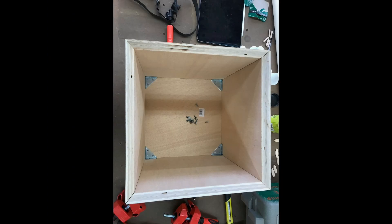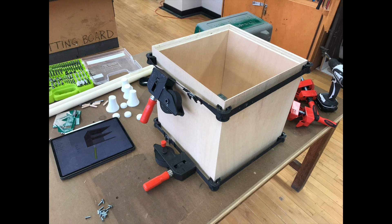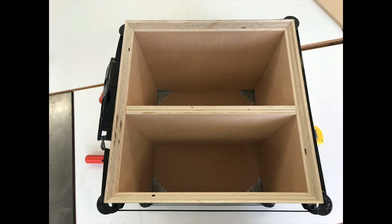Now I have all corners in there. See that the top opens a little bit because there's no fastening behind it — now I just put a belt up there too. Then I needed to figure out how big is actually the piece that goes in there. This board I cut at the end, not at the beginning, because I wasn't sure if something changed dimension-wise. So be very careful — don't just cut everything at once when you make your first prototype. Step by step, build your pieces, because dimensions might sometimes change a little bit.